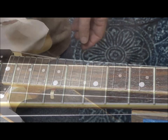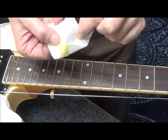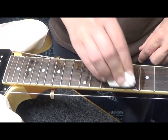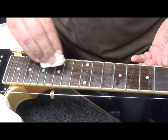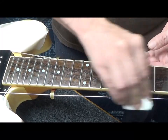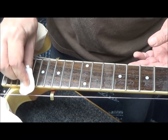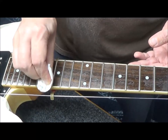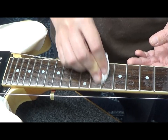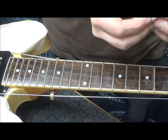You need a new brush. Cleaned with acetone and the brush. Very small layer of the tried and true. Very thin layer, I should say. It's kind of got the consistency of thick honey. Instantly, the board gets this more reddish, warm color that it didn't have before.